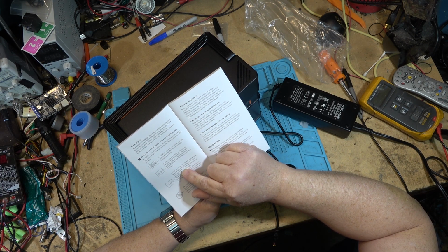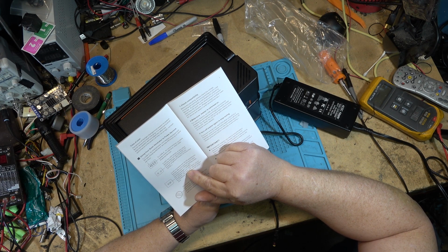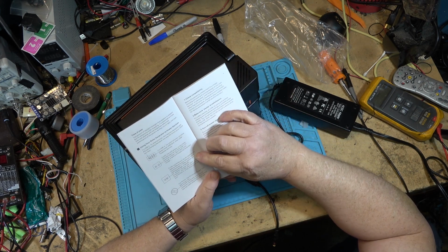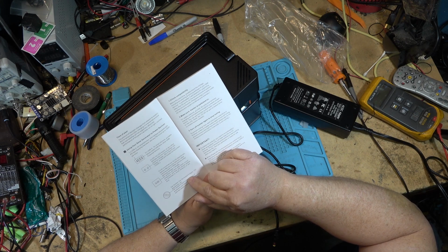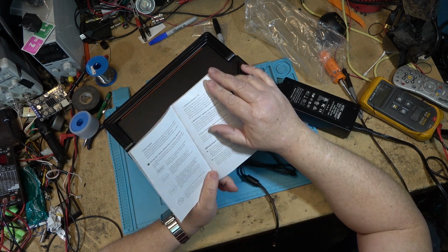AC output, it's a running power less than 700 watts. The initial starting wattage up to 1400. The AC sockets are built in with short circuit protection. Car socket for like onboard fridges and stuff, 12 volt appliances, and that will draw or provide up to 10 amps of power.